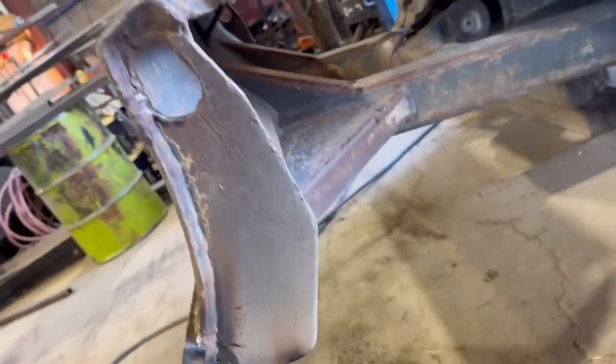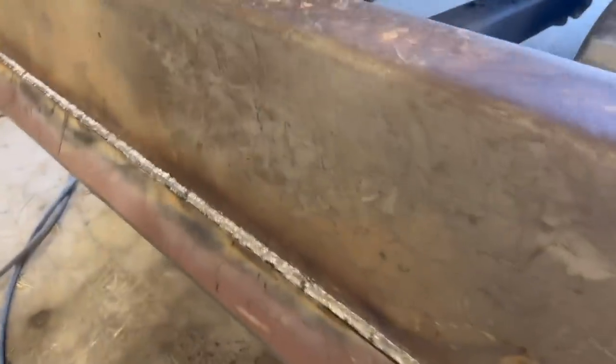We put a root of that Tartan B in. And that Tartan B has an 80,000 PSI. It ran exactly like a 6010, so I'm gonna assume it's basically an 8010. Ran perfect. So we got that, it's all knocked out.